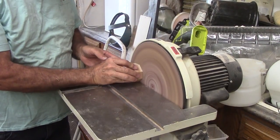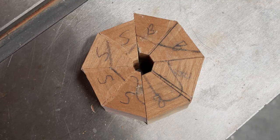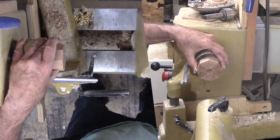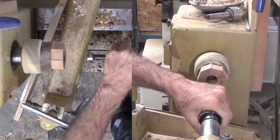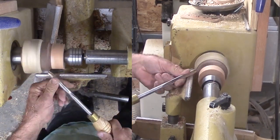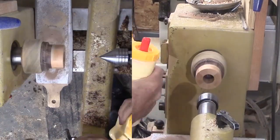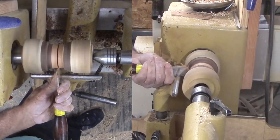Back to the sander. I need to clean up the reference surface again for the glue joint. This will give a good surface to glue to a faceplate. As you can see, my complete ring is far from perfect but it is enough for threading. Now glue the segment ring to a wood faceplate. I'm eyeballing the center and using the tail stock as a ram for glue pressure. With the glue dry, I can drill out the center and tool down the outside to a smooth surface. I'm going to split this ring into two — clean up the top surface, then bring up another faceplate in the tail stock held by a cone center, glue them together, and part the ring into two rings. Each is perfectly mounted to its own faceplate.